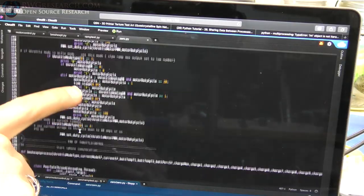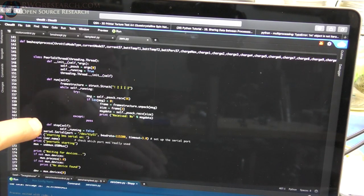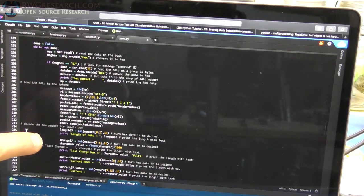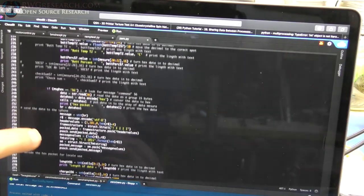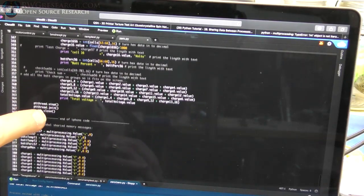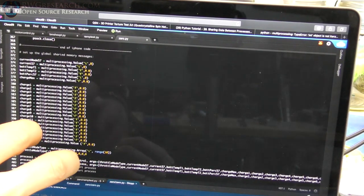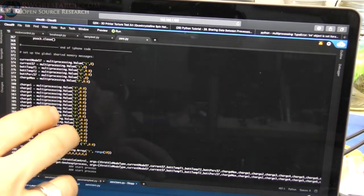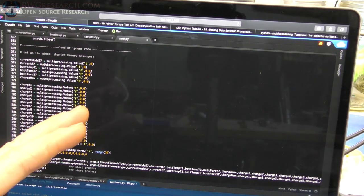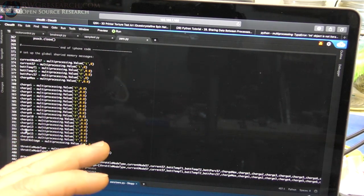So this whole first part is throttle control. Okay, and this whole second part is some of the code written from PeerTalk. So some of this I didn't write, but some of it I did modify and edit. Like here, I'm sending the packet data over to my iPhone. And then here I'm actually decoding the data and putting it into the actual values and doing a voltage total value. So I'm decoding the data on the iPhone and actually putting the work in the iPhone to process that, and I'm also processing it here locally, because what I plan on doing is saying, oh, sorry, I'm going to turn off the motor control now because your voltage is too low. So it's a way to control the motor and do safety shutdowns without actually turning anything off.